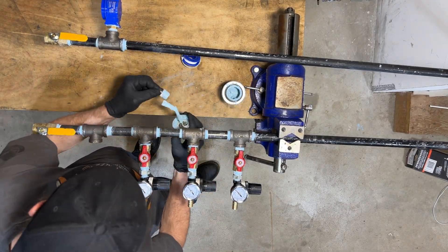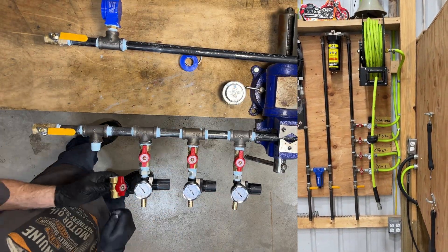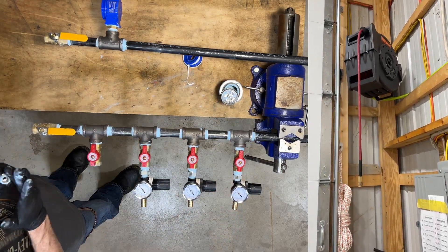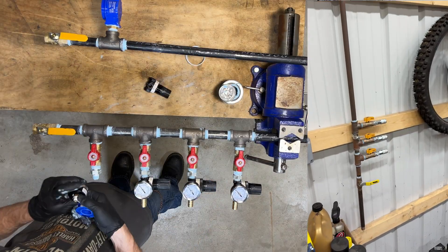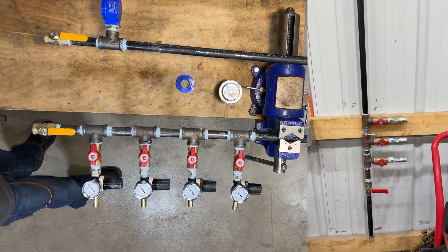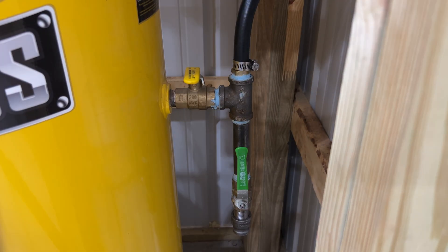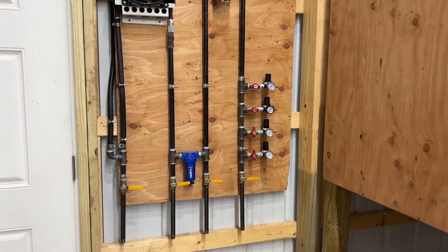We're on the last one now — finally almost finished. Now I'll have four different airline drops. One will be for the hose reel right above the manifold, located in the very back of my shop. The second one will go to the front of the shop, both on reels as convenience airlines. The other two will be drop-down pipes with three quick connect ports to connect different airlines and tools — one located at the two-post lift and the other at the motorcycle lift. And there it is, finally finished. Let's get this mounted up. You can watch how I get this connected to my air compressor system as well as many other air compressor related videos. Thanks for watching — hope you enjoyed it or it helped you out.